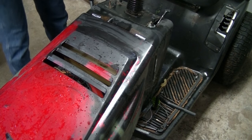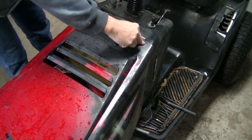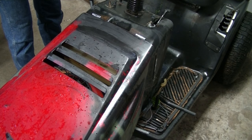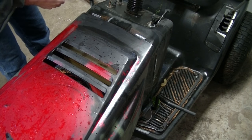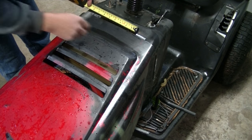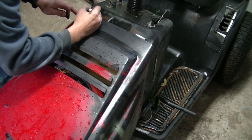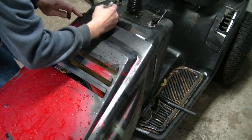What I've done here is I've placed the hinges folded up underneath the closed hood. The hood is going to rest — because of the thickness of the hinges — almost a quarter of an inch up from where it was, and I think I can live with that. I could go to great lengths to inset the hinges and get this thing sitting completely flush, but it's just not worth all the added aggravation. I've taken a couple of measurements off this little handhold here, about an inch and a quarter on either side, just to get my hinges equally located. I'll make some little marks with a Sharpie marker so that I can locate them again, and then start drilling holes.